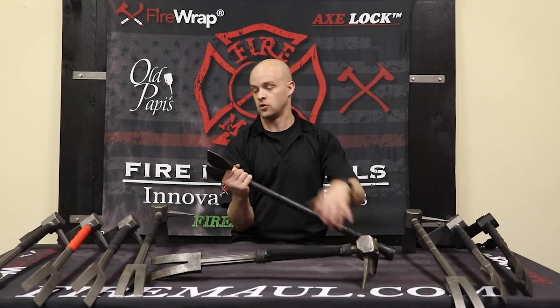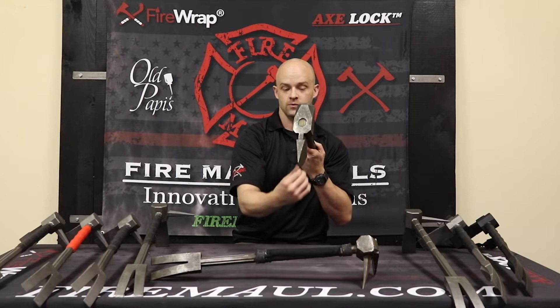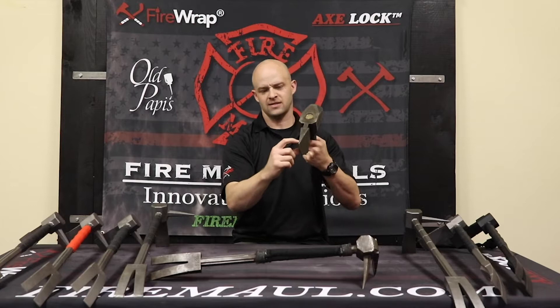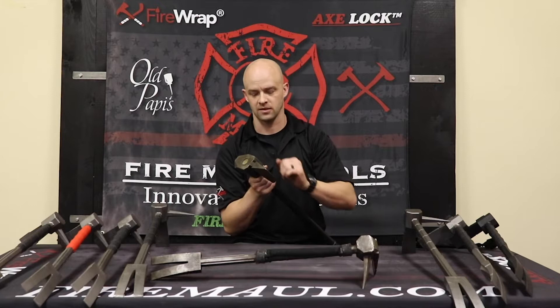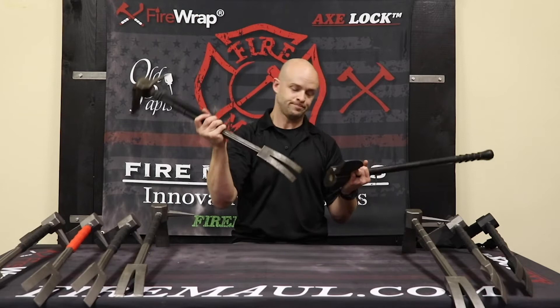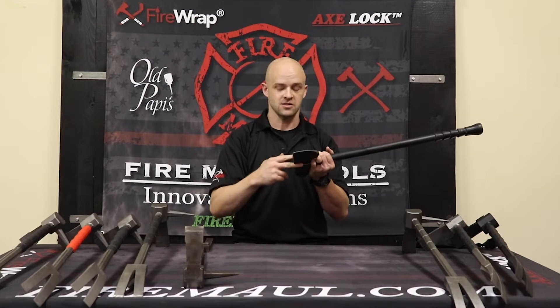Some of the features of this tool: flat top, and the blade itself. One of the things we're going to want you guys to focus on is using that blade like a wedge — it is wedge-shaped like a force wedge. The sides are 90 degrees and they don't taper down until about an inch, forming about a one-inch wedge that is perfectly in line with each other. I have some notches on here. Those notches are made for if I am driving it — hopefully they catch and keep the tool from bouncing out, just to catch that door and that jam a little bit. The notch itself can always be married to our Halligan bars. The one Halligan bar you'll find is the original pro bar — it gets a bit of a shallow marry in there, just a little bit shallower, not as deep as your Max Rex or the TSR in particular.